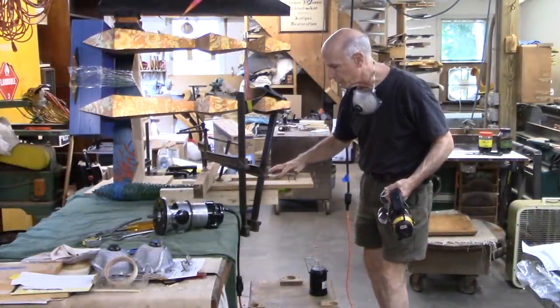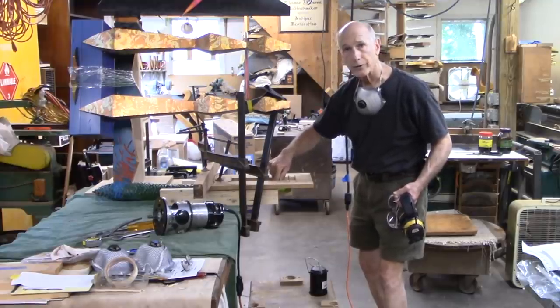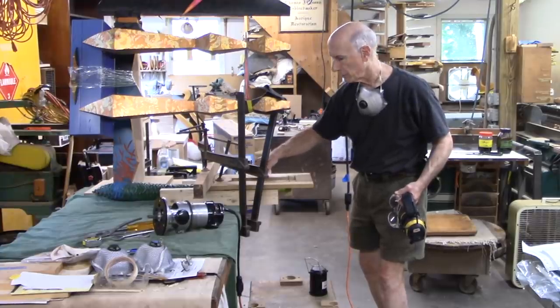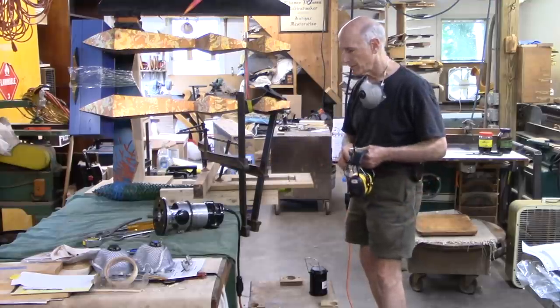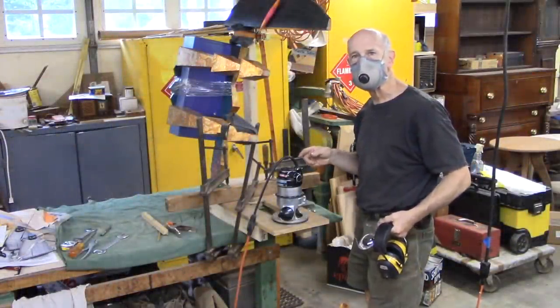I realize now I'm going to do this in two stages. I've been cutting the lower part of the leg here and it's nice and level, though I need to go a little deeper there. But the upper part of the break I can go a lot shallower, so I'm going to do this in two or maybe even three stages. I finished up the first cut and now I've got to switch to a shorter router bit. I'm going to step this up even a third time and really minimize the amount of material I'm taking away.